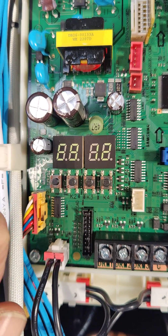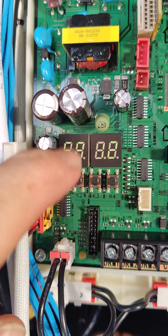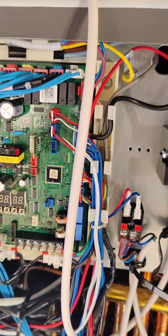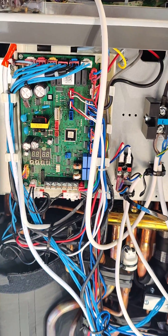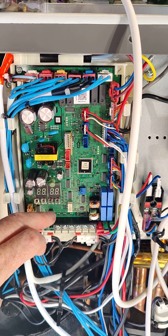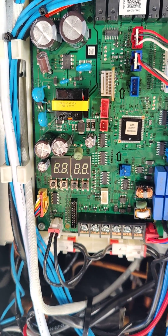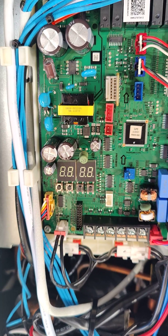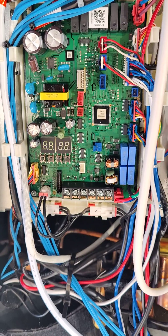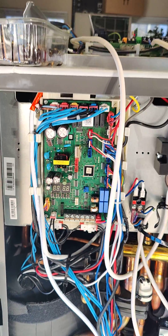This has always been the case on Samsung units, right back to day one — these buttons are always used for these functions. If you think you've got refrigerant problems or your unit's not working well, get the unit running and then go through and press the K4 button. I tend to video it like this and read what it's saying — for example, 105, 206 and so on — because the phone doesn't pick up the display. Then send that video over to your technical support guy. It's like they're inside the unit, which makes it really easy to fix the system.